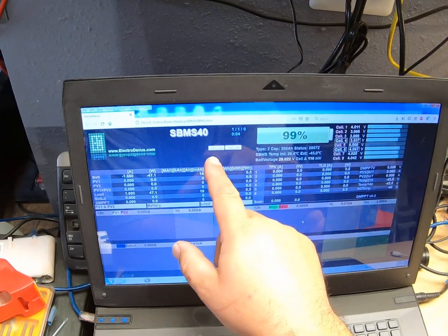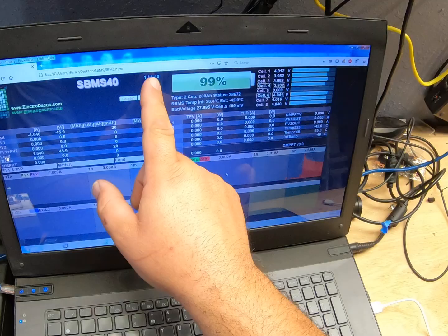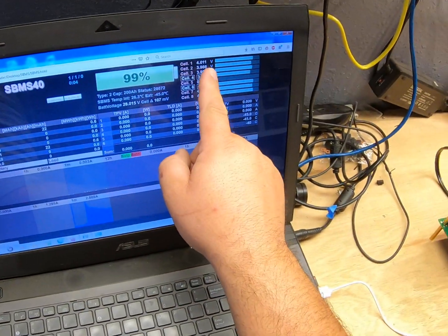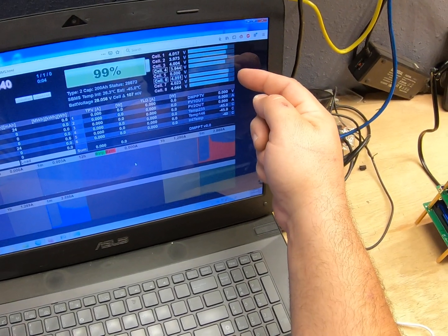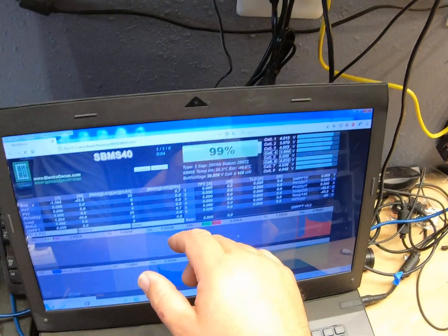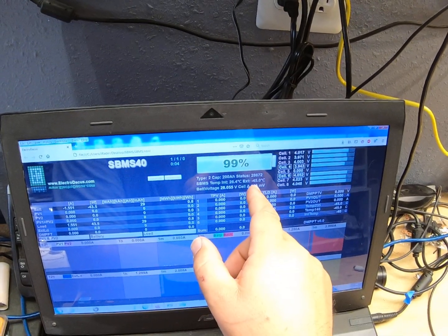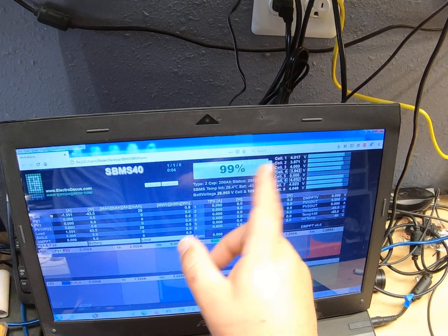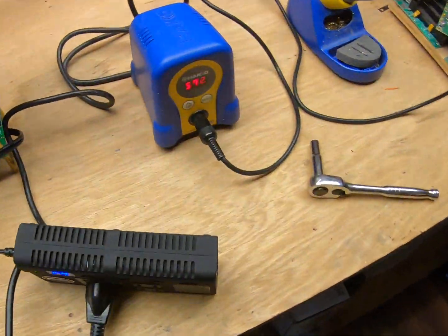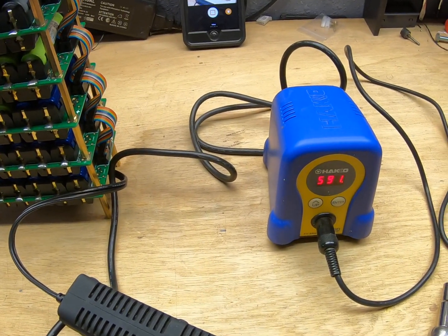Battery amperage, load amperage is 1.8 amps at 49 watts, 14 milliamp hours used, and 0.4 watt hours. It also has logging you can save — I haven't set the time and date so that's not displaying properly. Over here you get the main battery graph, all individual cells — you can see they're not balanced since I didn't do a charge balance on this pack. It gives you temperature, battery voltage, internal temp, external temp if you have external sensors hooked up, capacity, and status.